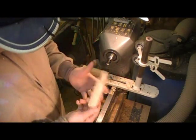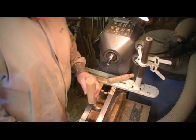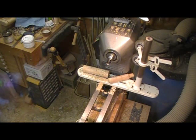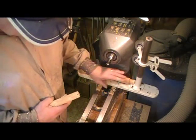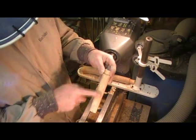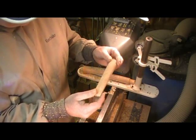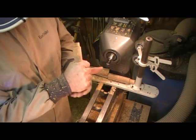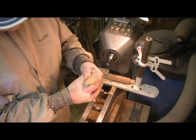But that's one thing you can do with multi-axis turning. On this one I offset both ends of the spindle. On this one, I only offset one end of the spindle, so this end stayed round, and the triangular portion sort of fades out along the length of it. Now that also tapers, so it's smaller at the heel of your hand than it is at the front, but your fingers are smaller there too. So that's not a bad shape either.